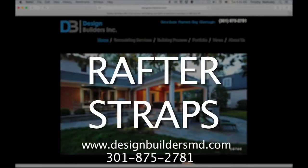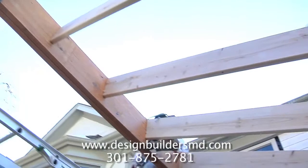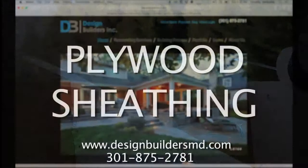Rafter straps. Used when trying to create an open cathedral ceiling without collar ties. The rafter strap straddles the ridge beam so that 12 inches of the rafter strap is on each side of the rafter on both sides of the ridge.